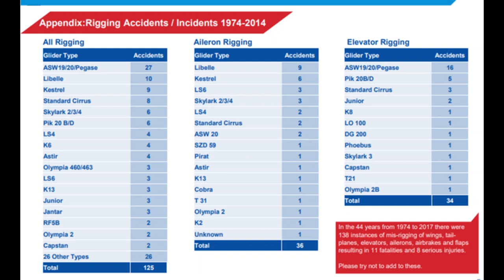Finally, once you've done that, carry out a positive control check — have somebody in the cockpit move the control while someone at the control surface checks it's fully connected, checks for free play, confirms it's moving in the correct direction, and that the approximate movement seems right. Typically an aileron will move two times up to one times down. After all that, you should be fit for flight.